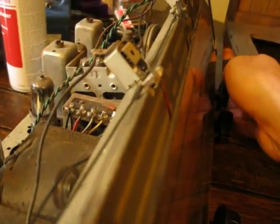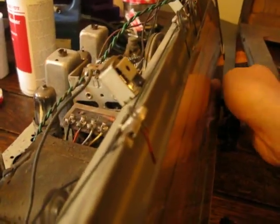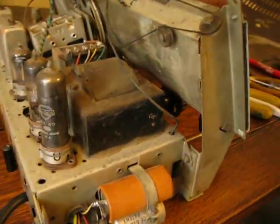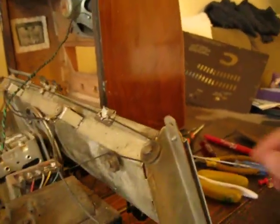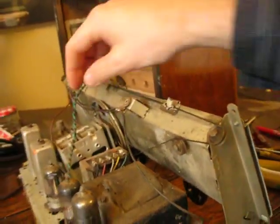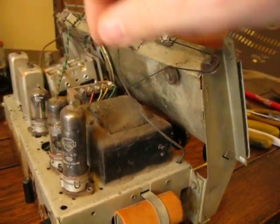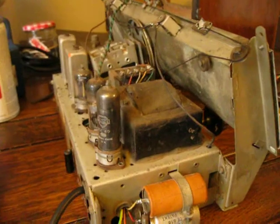The other mechanism, the tuning dial, is also very stiff, but I've cleaned that up. And when I say switch it on slowly, I'm not replacing all the capacitors, but I'm seeing which ones fail very gradually. I'm switching it on in increments — like 10 seconds, 20 seconds, half a minute.